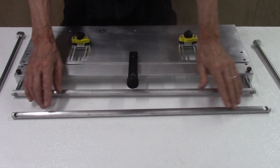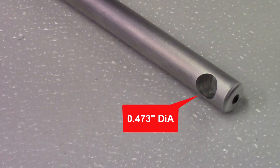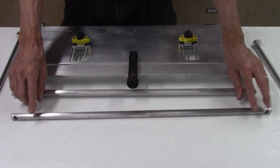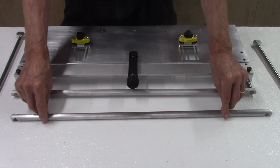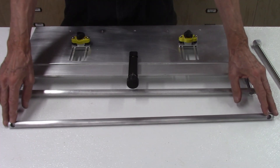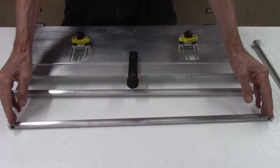The first operation involves machining the two 0.473 inch diameter holes on my Precision Matthews Model PM30MV Mill, which I've modified for CNC operation. These two holes must be precisely centered on the side of the bar, perfectly straight and parallel to one another, with the spacing exactly 25.5 inches between each of the two holes.